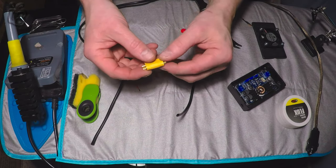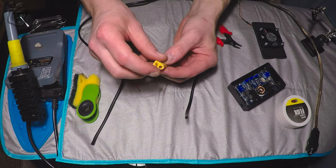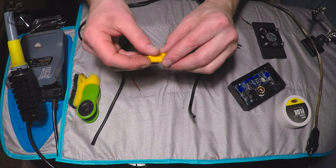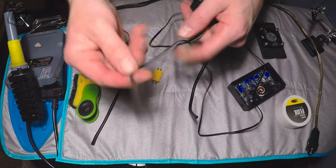Always when soldering these connectors in, try and keep the pin housing in place. Sometimes if you don't, the heat generated as you solder in the tip can actually bend the pins. The other end of that pin is then going to be connected onto this.